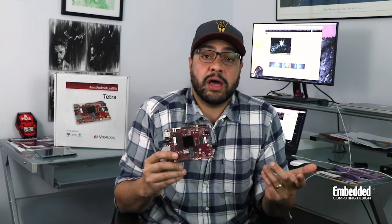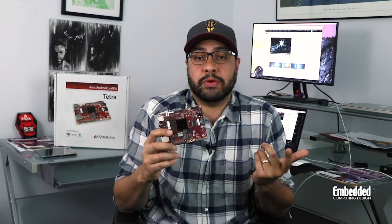So from now on, I'm going to be a little bit more selective when I say that a kit has everything you need. The VL-EPC 2700 EDK eval board is equipped with a quad-core i.MX6 applications processor from NXP, powered by ARM Cortex-A9 CPUs. There's also a 2D/3D graphics engine on the chip. Accompanying that is 4 gigs of soldered-on DDR3 DRAM, 128 kilobytes of magnetic RAM, 8 gigs of eMMC flash, a SATA 2 port for high-capacity storage, a mini PCIe or mSATA socket, and of course the microSD socket that accepts the pre-programmed SD card.